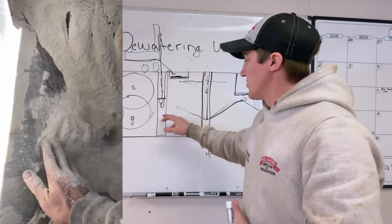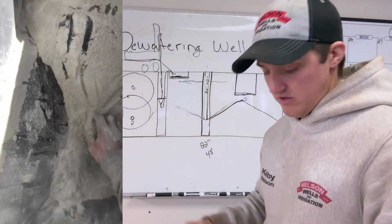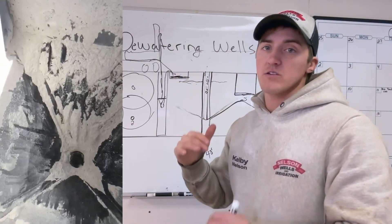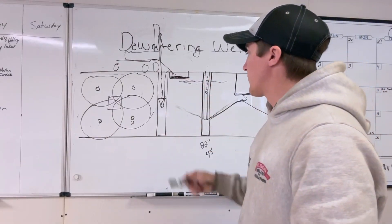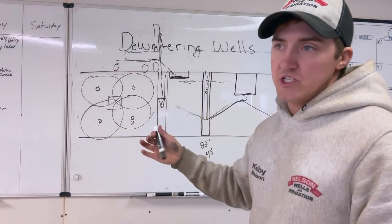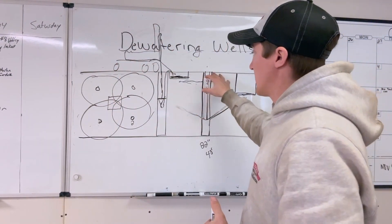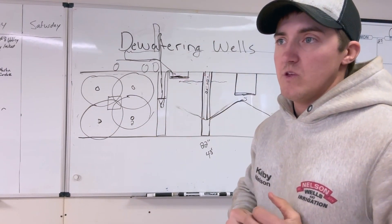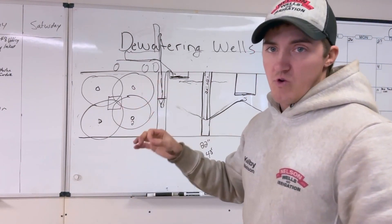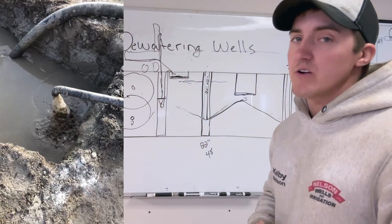In this video, we start out by mixing mud. We're running straight rotary when drilling a hole this big. We mix a lot of quick gel into our water — quick gel changes the viscosity of the water and will literally make rocks and stuff float. As the bit cuts through the formation, those cuttings float up. Since we're usually in scenarios where the water is high, it's typically sand or gravel.